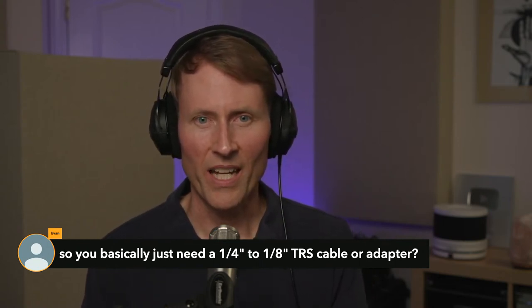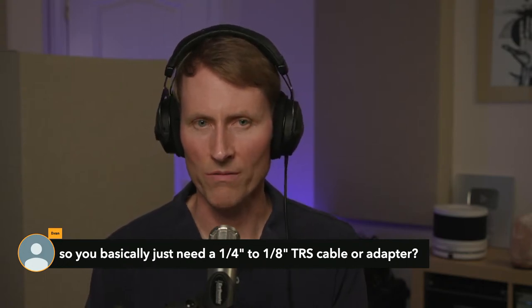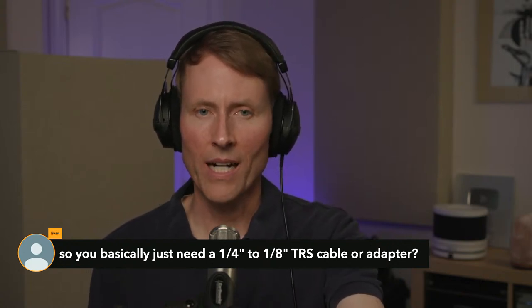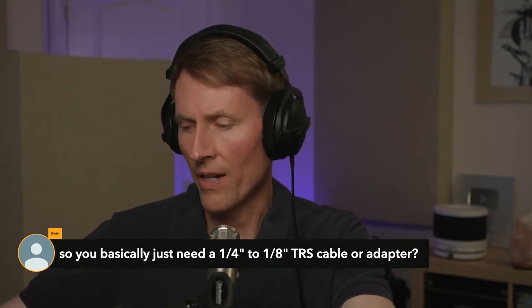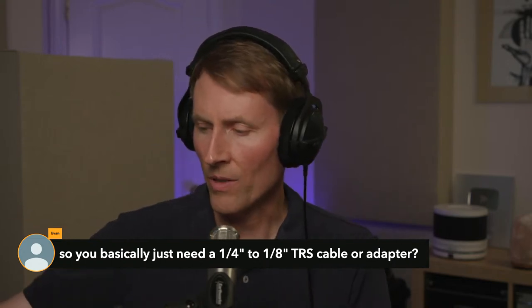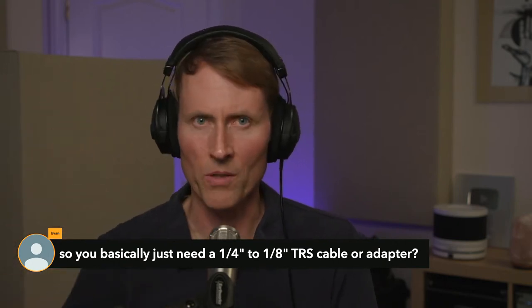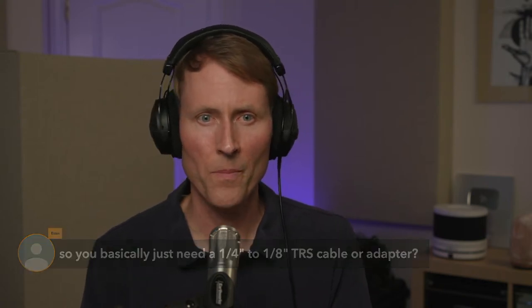So you basically need a quarter inch to eighth inch TRS cable or adapter. Sort of. I'm actually taking the monitor outputs. There's a left and a right on the RODECaster Pro, and then there's a single TRS input on the ATEM Mini. So I have a cable that's two quarter inch TS connectors on one side and a 3.5 millimeter TRS on the other. Again, I'll put the link for this cable in the description right after the live stream here, so you can see the exact one that I'm using at least.